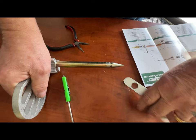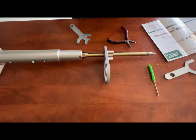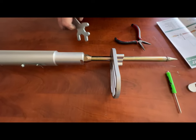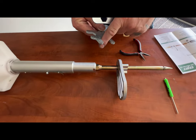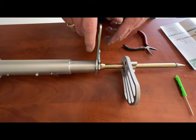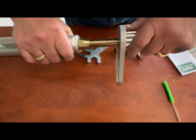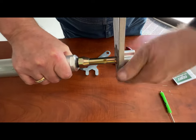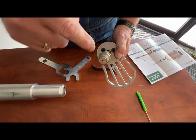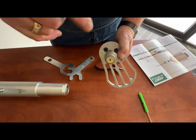To put in a new check valve, just press it back in the hole and screw the tip back on the probe. Holding the foot plate, use the wrench and snug the tip onto the probe. The last thing we're going to do is remove the probe from the piston cylinder, and you use two wrenches for that. Use the wrench with the larger opening over this nut, and the other wrench over the cylinder, then turn them opposite each other and it comes loose. And there is another check valve here — this one is called an S120, where the other two check valves are called an S108.